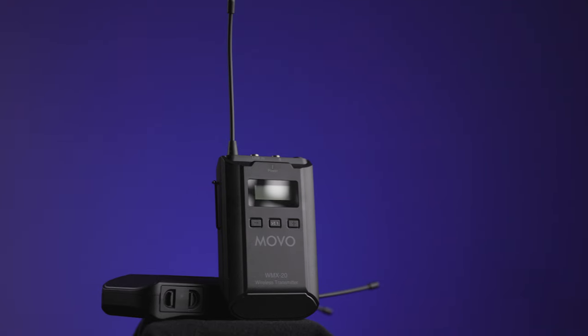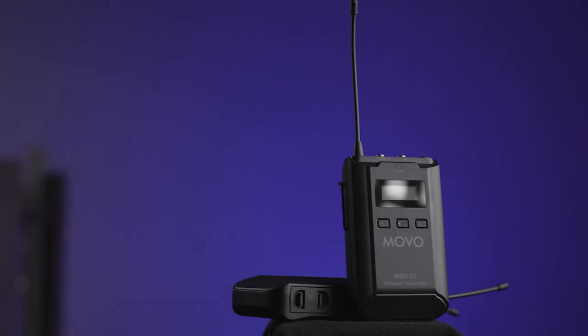As far as the range you can take the transmitter from the receiver and still get a signal, the advertised working distance is 330 feet. To be honest, I didn't try anywhere near that — I got about 40 yards from the camera. And even at that distance, even when I was turned completely away from the camera and walking away, it never dropped the signal once. That can actually be an issue with the Rode Wireless Go and Wireless Go 2 system — when you don't have direct line of sight to the camera, when your talent is turned away, it'll start to drop signal. With this Movo setup I had no issues with signal drop even turned away at up to 40 yards.